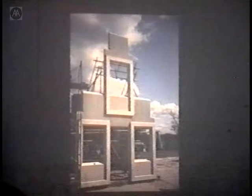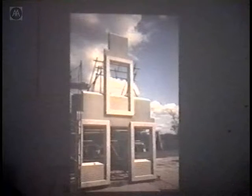But the back of the joint here will probably be in-situ concrete in a narrow strip. Then there will be a foam polyethylene backing strip, it's a bond breaker. And the face of it will be sealed with the chosen polysulfide, another flexible sealant, which bonds to both edges, not to the back. Then it can accommodate movement in the joint. And if it's an in-situ concrete back, the movement is minimal.